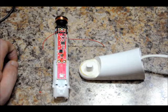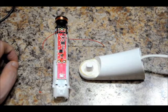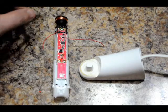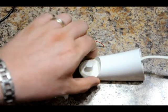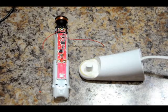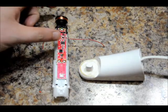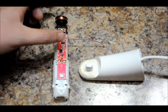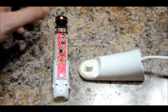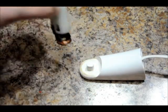The wireless charging circuit is relatively simple. I'm going to show you what I'm doing in just a second relative to where I'm measuring — we're going to measure the short circuit current between the transmitter coil and the receiver coil. What I've done is I've soldered two wires on here just to simulate a short circuit current with my multimeter.